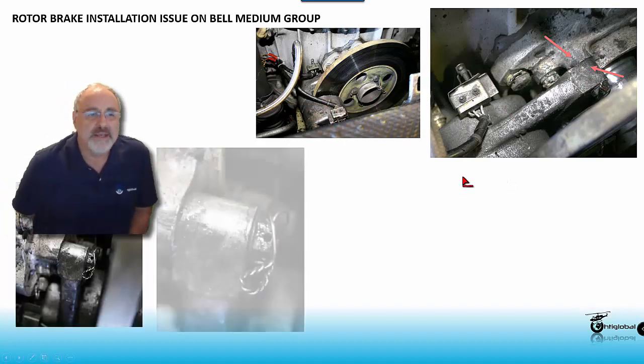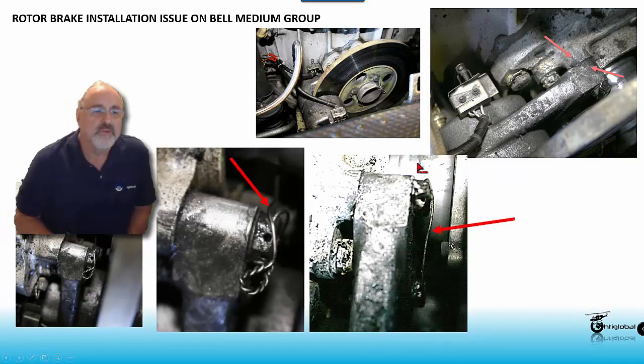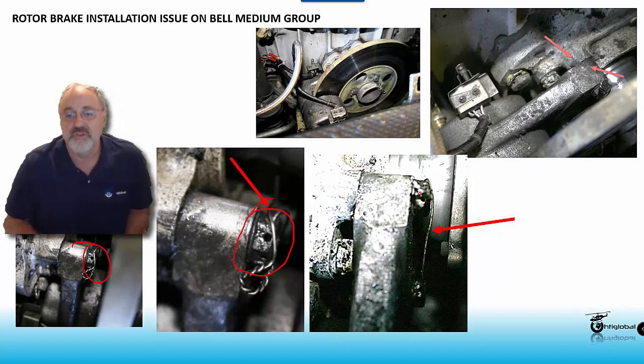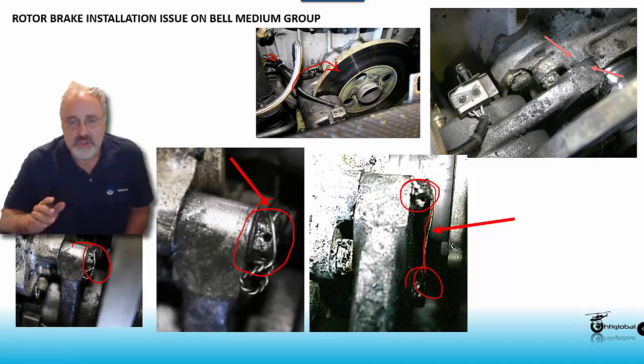This is what I found on this particular one. Remember I told you this is a cross safety wire — well, they did a single, and it's pretty loose. Because it's very confined behind the disc, this person really did a single safety wire. These bolts were not torqued down. Again, this is critical. Whoever did this is inducing — or already doing — a human error by not following the process. Be careful when you assemble and install a main rotor brake system.